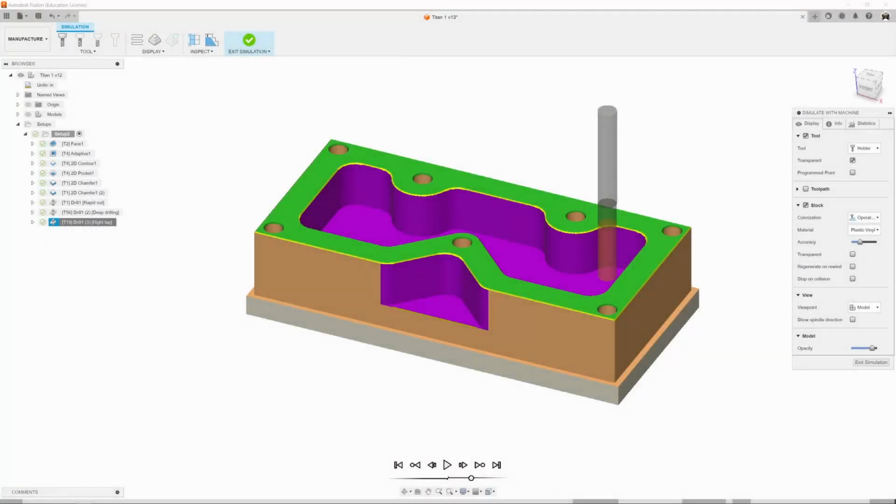We still have to flip it and machine off the hat, chamfer the bottom. In order to do that, we'll have to create another operation, OP2, and tool that. But it'll be fairly quick. It will be easier for us to do OP2 if we could visually see this, but flipped upside down. And fortunately, we can.